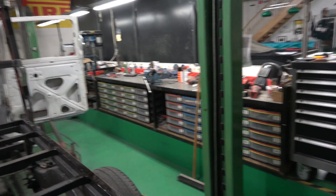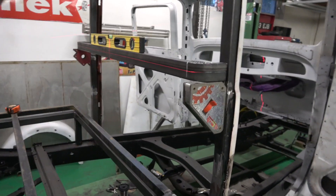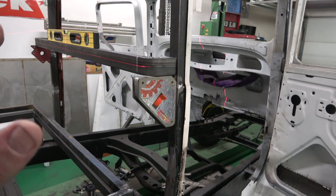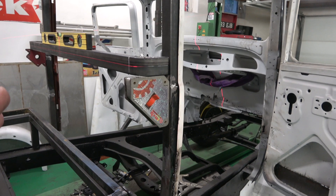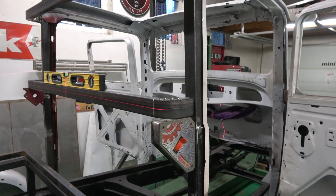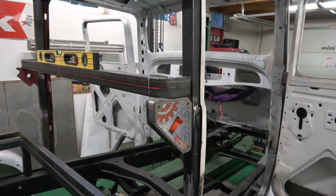I could come down a little bit further, but the reason I'm staying at that height is I'm going to have to make the back of this cab in two sections. It's too big to handle, but more importantly it mechanically won't go into the throat of the bead roller, so I can't put the bead in the back in one sheet.